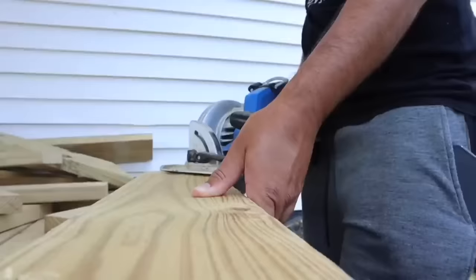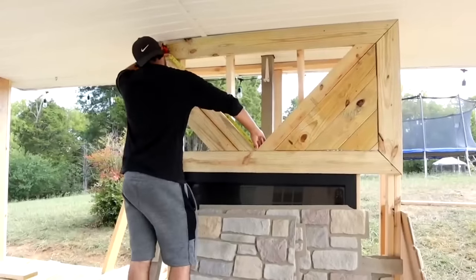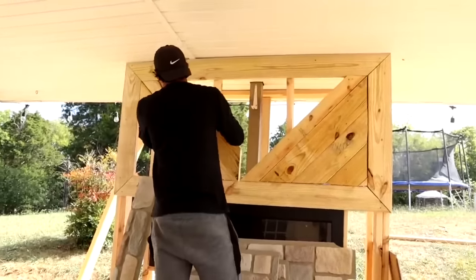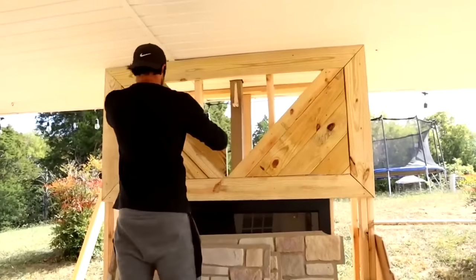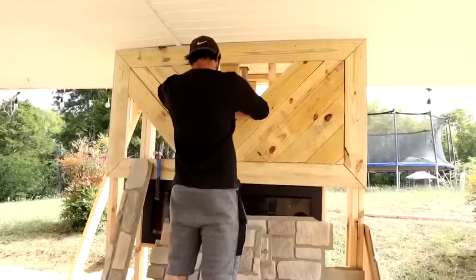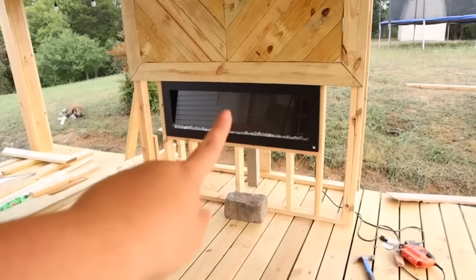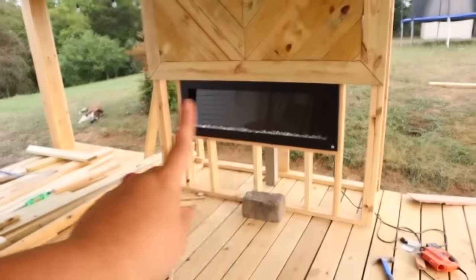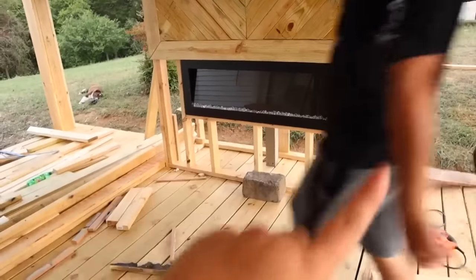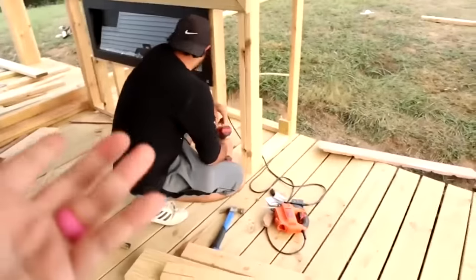We wrapped the tiny little beams that held up the roof, the support beams, we wrapped those to make them look thicker. And I say wrapped, I didn't even know there was stuff called porch wrappings or beam wrappings until I was over on my friend Jemarelle Stewart's paid website, where she had me featured. We were talking during a live stream, and she had just had a contractor wrap her beams on her house. And I was like, there's a word for that? I just thought we were boxing it in. No, it's actually called wrapping the beams to make them thicker, to make them chunkier. So we did that. We literally just boxed it in. That's basically what wrapping is. You just box wood around little wood to give it the illusion like it's bigger wood.